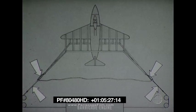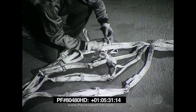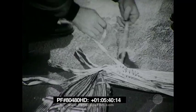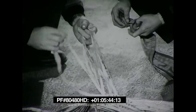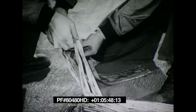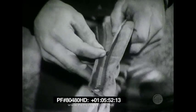The barricade webbing is assembled in the following manner. Starting at the corner of one of the assemblies, attach a release strap to each support loop using a lark's head hitch. When all five release straps have been attached, spread them open and cover them with a zippered canvas boot. Do the same at each of the other three corners.